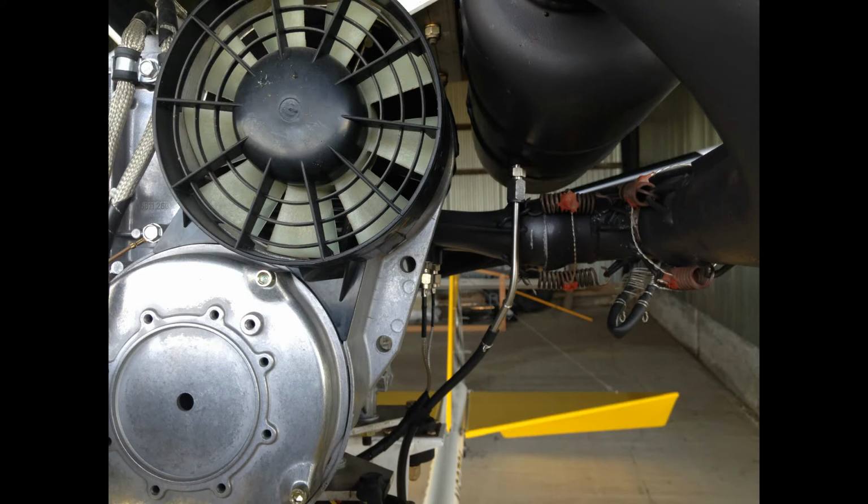Now, here's a picture from head on of the new injection port location. It's basically in the middle of the muffler, and for the most part, it lies outside of what you would consider to be the tuned portion of the exhaust. So that means that in this location, injection of the smoke oil and the cooling of the exhaust temperature does not have any appreciable effect on the frequency and the speed of the pressure wave, and so there's no detectable change in engine sound or RPM or anything like that in this location.